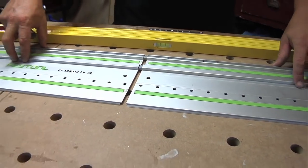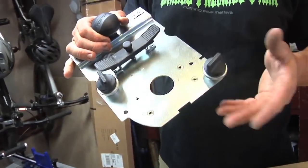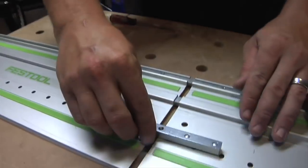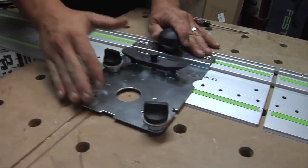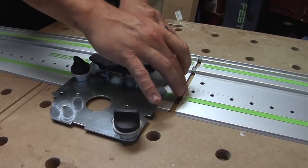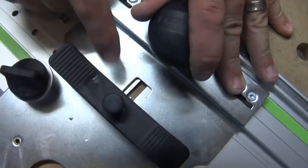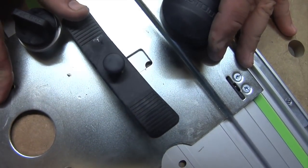Now we're perfectly spaced for the LR32 kit. I just grabbed the guide rail plate for the router to sit into — I don't have a router, but just for demonstration purposes. Double check our rail is nice and straight against our six foot level. And as you can see, this is all lined up perfect and we're ready to rock and roll. If you had your router in here, plunge it down — you're ready to go. Flows really nice and smooth right over that, didn't skip a beat, catching all the holes. You just have to make sure you don't fall on that track — when this little arrow is lined up there, you're not in the right spot. So always remember that when your rails are joined, you do not want to be there. You want to be before it, skip over that, next click — that's your hole for that 32 millimeters of spacing.